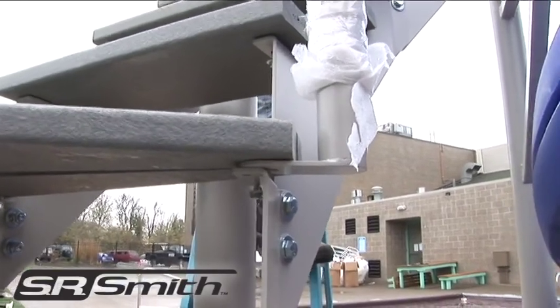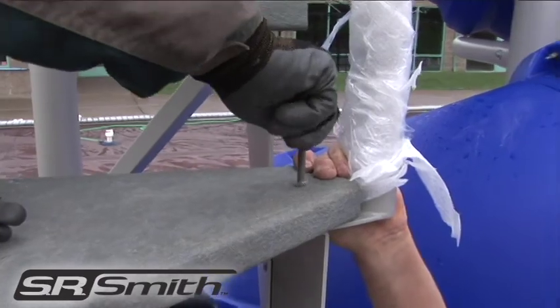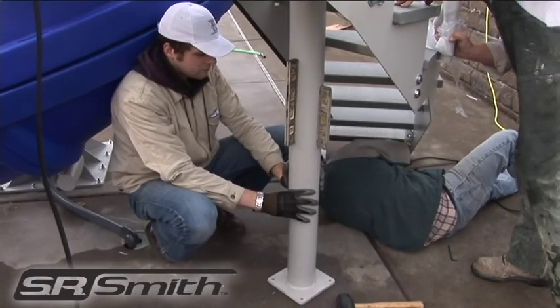On steps 1, 5, 8, and 11, slide the handrail bracket between the stair tread and bracket and place hardware loosely. Make sure the mid-stair support and the stair treads are level and shift the staircase as needed to achieve proper alignment.